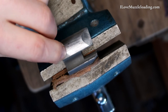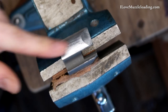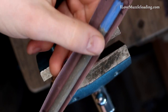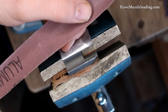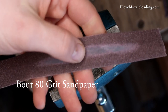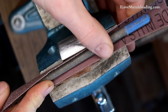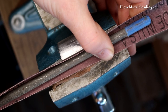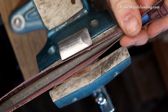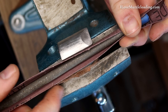With this face cleaned up now, I'm going to go through and show you how I'm going to clean up this ramrod channel here. I'm not going to show you how to clean up the other side because it's just going to be a replication of this side and the series is already long enough. So to get in here and clean up, I've got a round file — this is a Nicholson 516 number 185 — and I've got some coarse sandpaper. I like using the sandpaper on something like this because it's going to kind of mold to the shape of all of this. This technique is file-backed sandpaper, and it gives us a stiff support behind our sandpaper so we maintain crisp lines of the part.